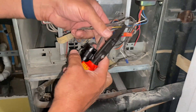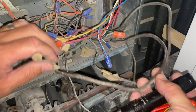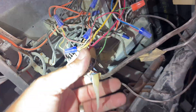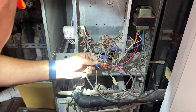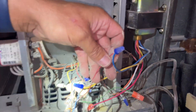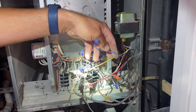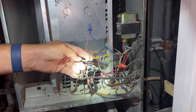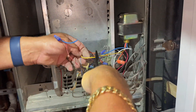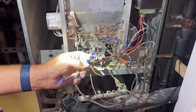So we have several wires coming in here. The one with the thicker wire is always going to be our thermostat - sure enough, it says Zone 8 Thermo Kitchen. An easy way of telling that is our red wire will always be our 24 volts, generally. But if we're unsure, we'll follow it. The red wire is going to our blue, and the yellow is our common.